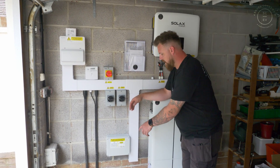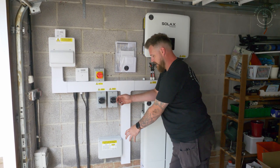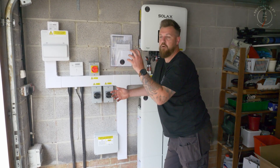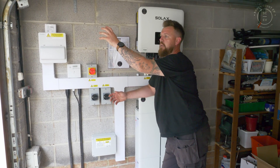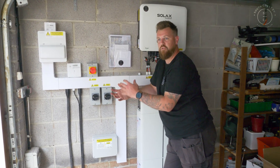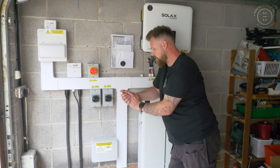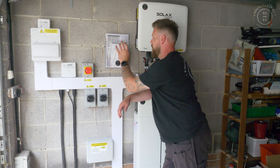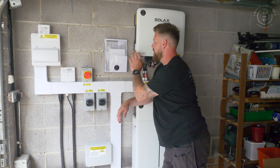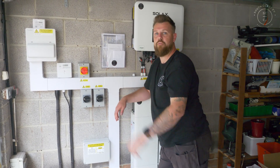The Tigo system — we've got optimizers across the whole system because of the shading. In this enclosure we've got what's called the Tigo Cloud Connect. Effectively what feeds into that is an RS485 cable which goes up to the Tigo TAP unit that sits behind one of the panels, with a voltage reference and relay next to it. This gives you access to their app, which allows you to see a full overview of how the panels are performing and if there's any shading on any of them. Lastly, up here we've got our leaflet holder which will have all the documentation on shutdown procedure, any gen on the inverter and battery, and all our contact details.